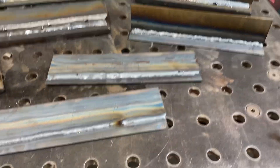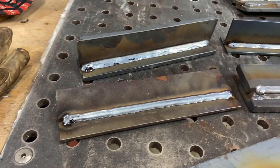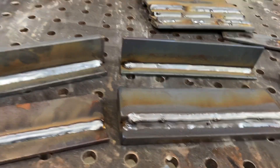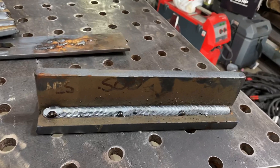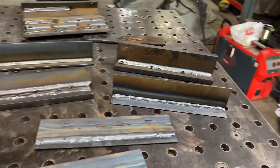You can see a variety of weld coupons we did: thin short circuit, multi-pass lap joint, single-pass lap joint, eighth inch, half inch multi-pass, half inch lap joint, quarter inch single pass, horizontal T-joint, eighth inch T-joint, a little weave test on half inch plate, and another T-joint horizontal fillet weld short circuit. Favorite was probably the thicker stuff. The thin stuff ran good too — super spatter-free. You could definitely increase your speed. The 30% increase in travel speeds and deposition is definitely real.